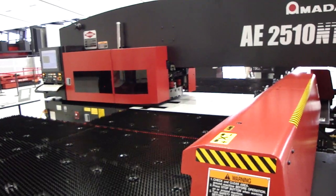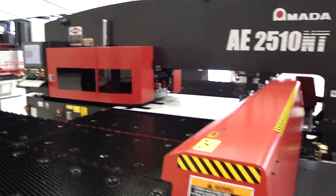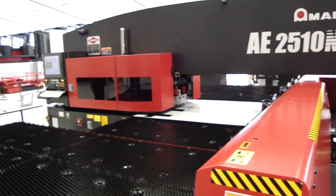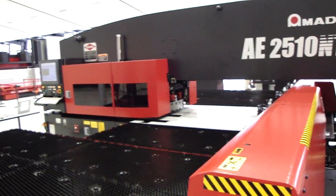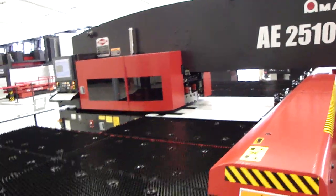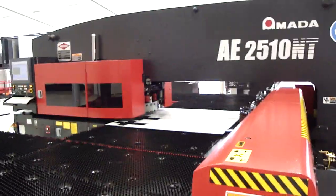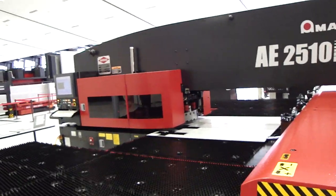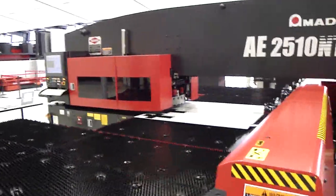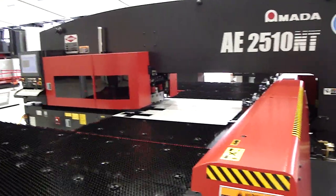Same with forming tools — they got the stamp tool where you can just come in one shot, you got numbers. On some of our parts we used to have to stamp the job work order number into the parts so they could track it if they got rejects or something. They just looked that number up on the side of the part. So when you got four or five parts nested on the sheet, you'd run out of tools. This would be a lot better where it's written in the code to make different numbers.